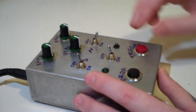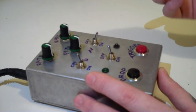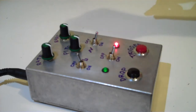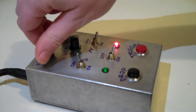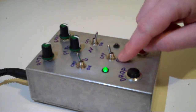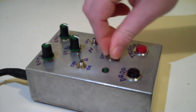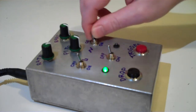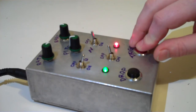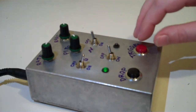And then you can switch on an LFO. So that's a triangle one. And you can change the rate. I'll just switch it on. So that's continuous. The switch for the continuous mode is also hooked up to the envelope and VCA. So that won't click either, which is good. So if we just change the range there, so it's a bit faster. Maybe we'll put the square wave on, turn the pitch up a bit more, and get that kind of classic high-low siren.